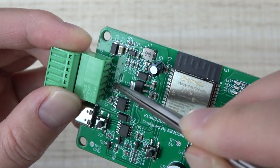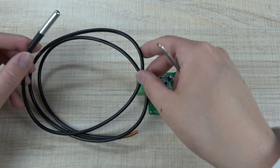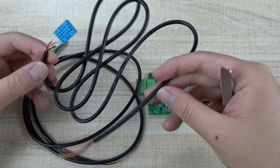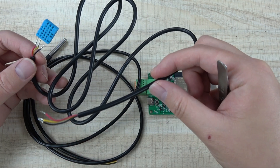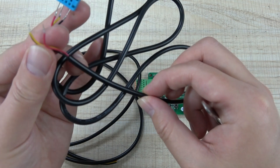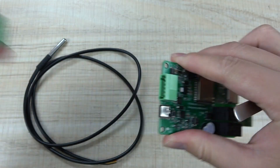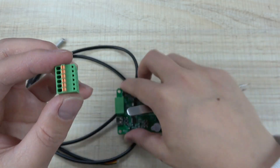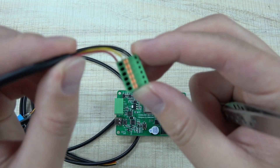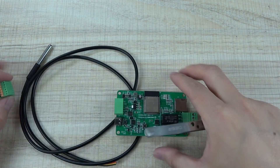This is TE1 and TE2. You can connect TE1 and TE2 with a temperature sensor such as DS18B20, or you can use the temperature and humidity sensor DHT11, DHT22, or DHT21. The socket is also removable — just hold down and insert the cable.